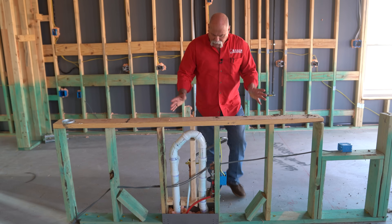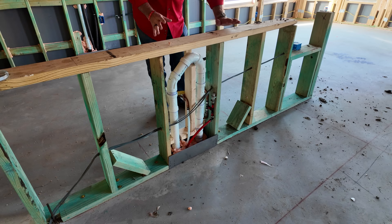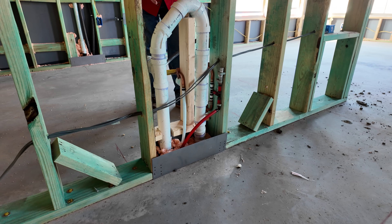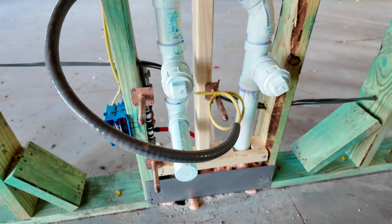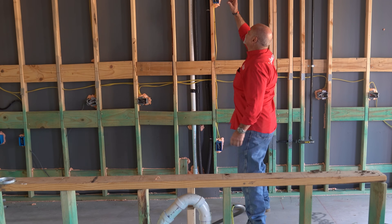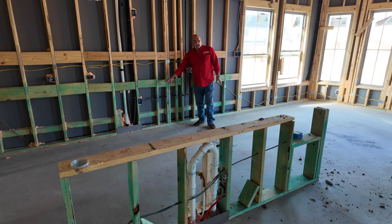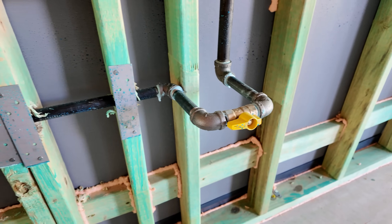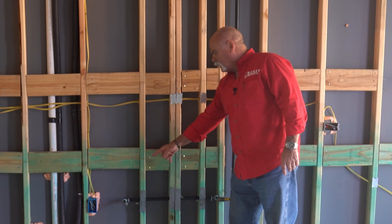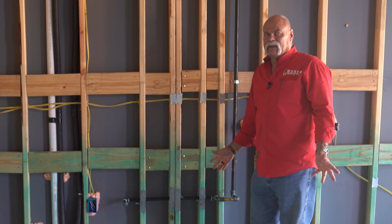Now, welcome back to my kitchen — it looks a little bit different now. You've actually got the drain line down here. You've got two clean outs and you have a loop vent. The water lines were brought up in that flexible conduit that we showed a while ago — it comes up, you've got two hots, one for your dishwasher, one for your sink, and you got your cold on this side. Over on this side, there's your vent going up through the roof and your hot and cold water lines coming down that loop up to catch your sink. And another thing — you can tell you're going to have a gas range here. They've got a three-quarter inch drop, a half-inch line coming out. This is the valve, and I love this because your gas stop is not right under your sink. You've got it over here, so literally all you have to do is put a flex connector on and go right up into the regulator. This thing is really ready to go.